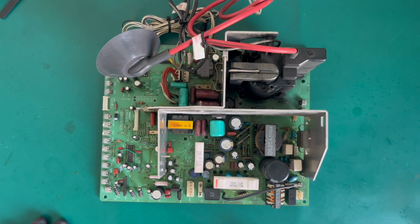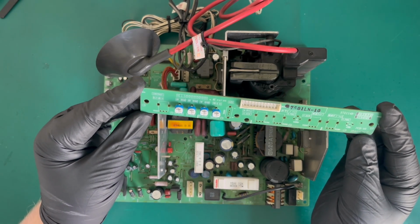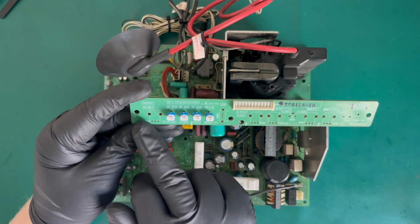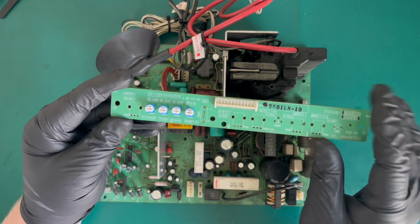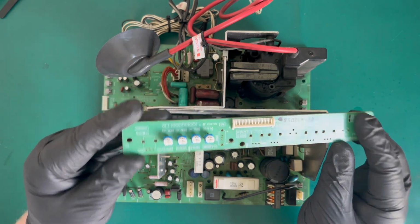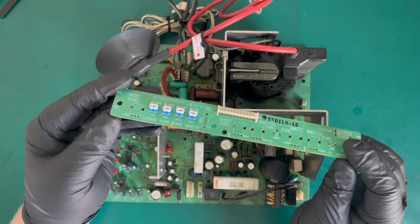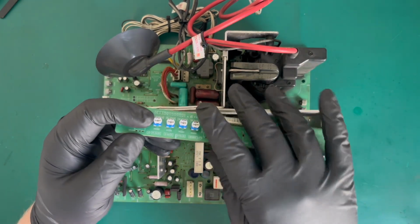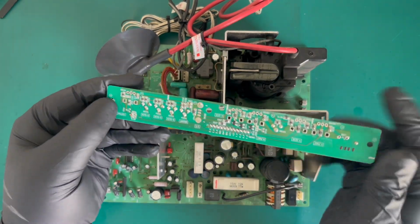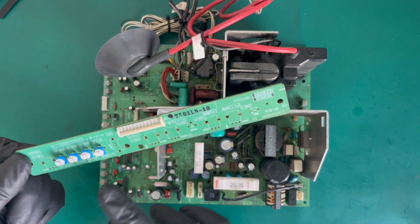Okay then, guys. I've shown quite a lot already. I had the potentiometers delivered yesterday for the remote board, the 332s. I've found the correct replacements for these now, so they will get ordered, but they won't be here for a week or so. You can see they're not quite in alignment. The legs, sadly, have a slightly different pitch, or you need to bend them a slightly different way, so I ended up having to freehand it. But it's for my personal machines. They're relatively in line, nice and secure, and they're not going anywhere, so I'm happy with that. They're soldered and I've done the connector as well, so that's all clean, ready to go. I'm just waiting for the new 5K and 10K pots.